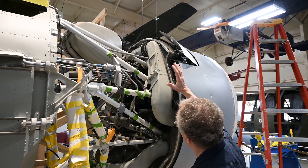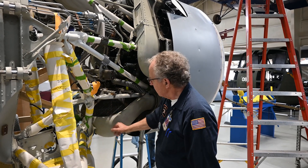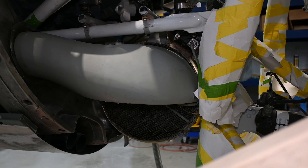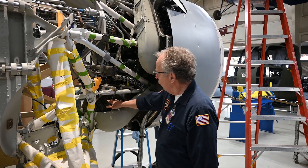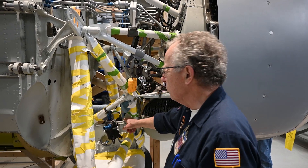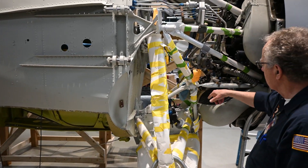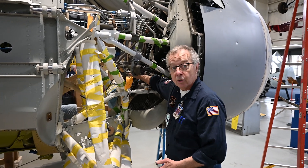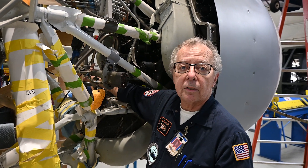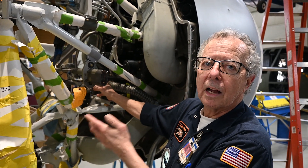We put the ductwork on — the ductwork was already on here but we had to put this ductwork on. We installed the oil cooler down here. It's an interesting deal because you've got a duct on the other side on the top, so the air blows through in a reverse direction for the oil cooler. We're mounting the fuel filter here, the fuel pump over there. We're coming out of the fuel tank down below, going back to the selector and then coming forward, so we've been starting to install these oil and fuel lines and connecting that all together.